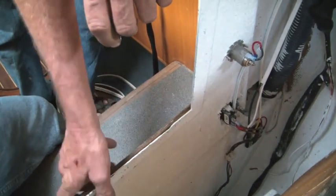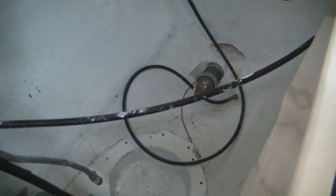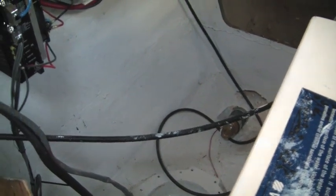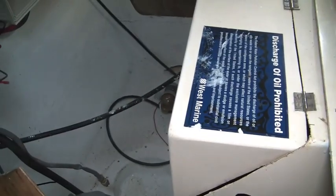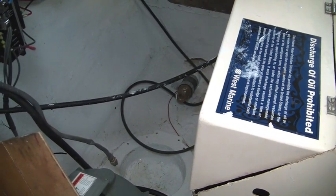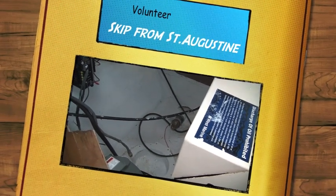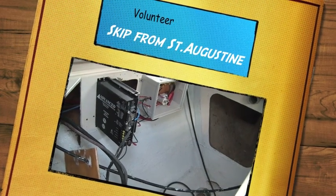We decided to use a normal stuffing box here, so we will have a little bit of water in the bilge and it'll evaporate, or if we have any other issues, we'll have that solved. How many gallons per minute was that pump? A 500? I think that's a 500 gallon-per-minute pump. There's new hose, new clamps and stuff, so everything's done except for the forward bilge pump on the starboard side. There's a pump in there and there's wire, but I think we're just going to run all new stuff.